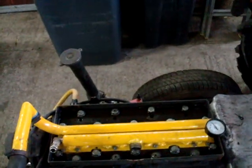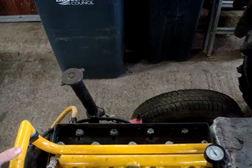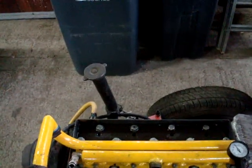It's just like most air compressors that you get, just that this one's a lot bigger. It's 2.25 litres. I think 550 cc per cylinder. It's a 90mm bore by 88mm stroke, which is like 3.5 by 3.5 inches, more or less.